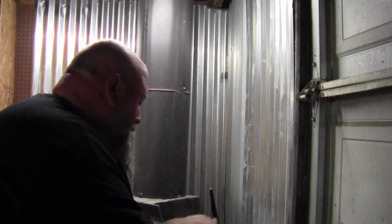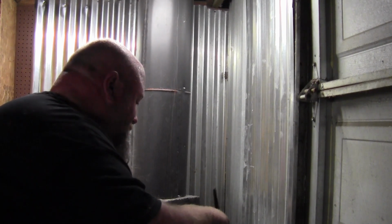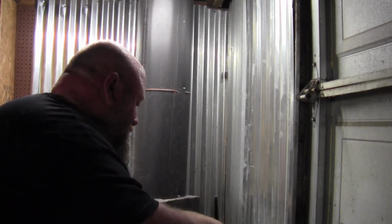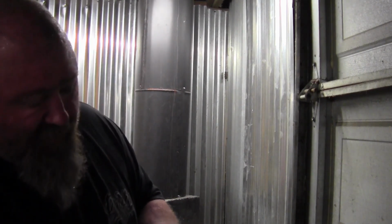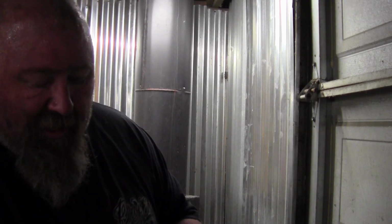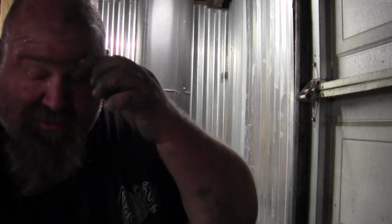So, like in those really tight corners in that car, we're going to want to be able to work our dings and dents out. And so the next two videos are going to be making a shrinking stump and a tucking hammer. And doing the shrinking will be a whole lot easier with the stump. There's a reason why the flat side of the anvil is not working.